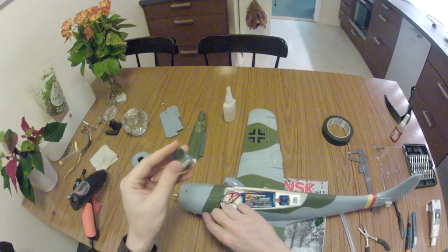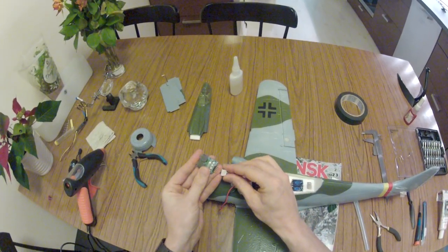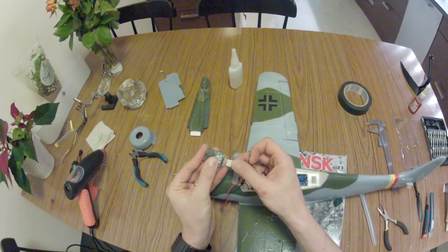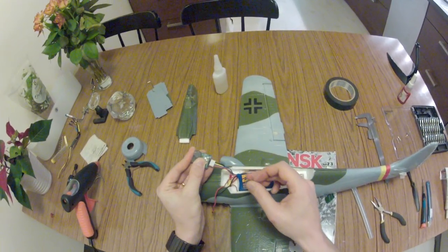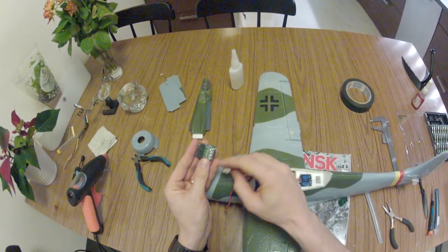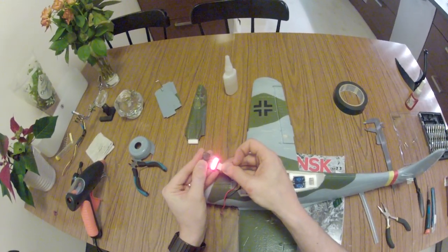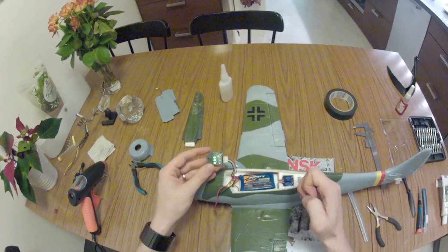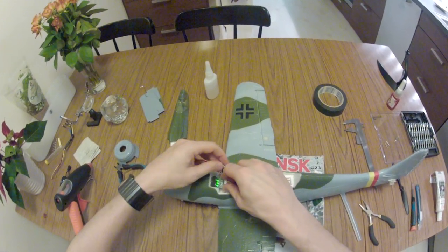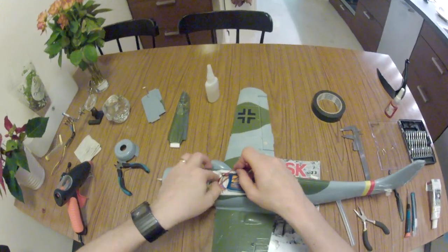It's a high-pitched alarm for low battery warning. You just plug it into the balance port. Watch out. Oh, wrong way around. Hope I didn't fry it. So it's minus there. It shows the voltage on all three cells. It will start beeping if it goes below 3.3 volts per cell.